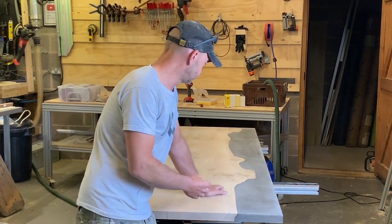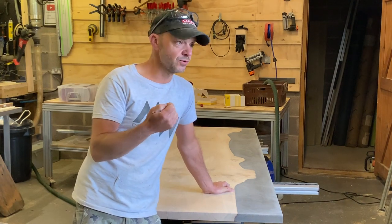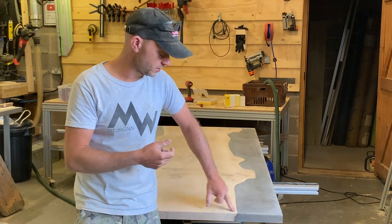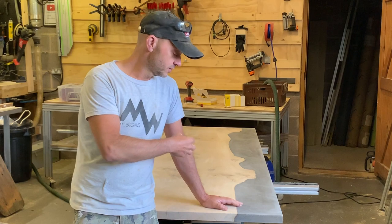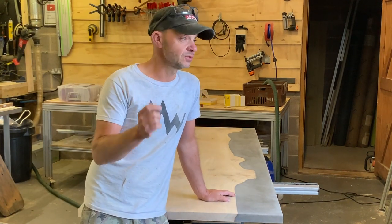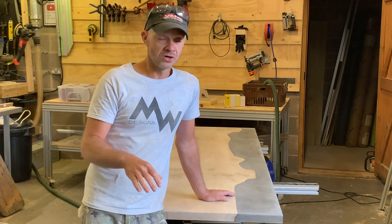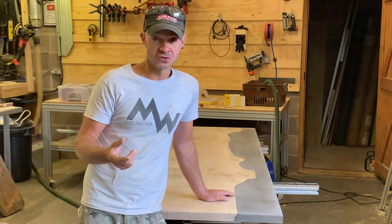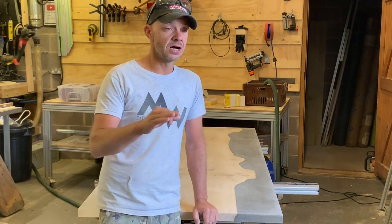You can seal the edge if you're worried about bubbles — especially on a gnarly piece like this one where it's really gnarly and you've got those lovely cat pours and burry stuff. It can be really dusty and very hard to clean. If you don't seal the edge on something really gnarly, the resin can catch little bits of sawdust or bark you've not completely cleaned. So sealing the edge isn't always just for bubbles or gases — for me, it's to stop the wood contaminating the resin, especially on a clear one. Clear resin is the hardest of all because you cannot have any contaminants, not a speck of dust. That's the reasoning behind why I do it. Sealing the edge takes extra time, so if it's a nice piece of wood and I'm not worried about bubbles or gas problems, I don't bother most of the time. But I do if it's a gnarly piece of wood or a particularly deep pour and I'm worried about heat build-up.